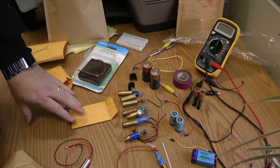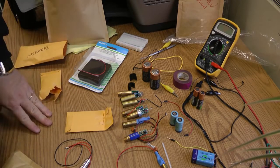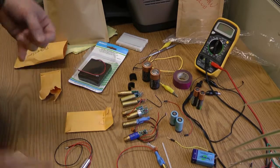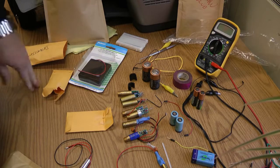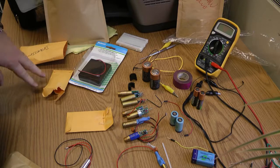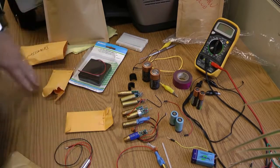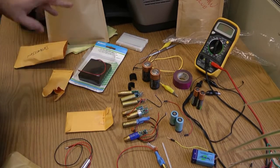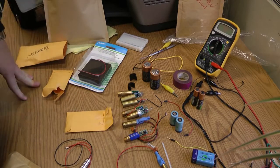There are three kinds of lasers we're going to deal with — we're not doing helium-neon or argon or any gas lasers. We're dealing with small laser diodes: 150 milliwatt blue, 300 milliwatt red, and 200 milliwatt green. Each of these lasers has some light your eye can't see. The red laser has some infrared light, and the green laser, even though it's in the middle of the visible spectrum, also has some invisible light.